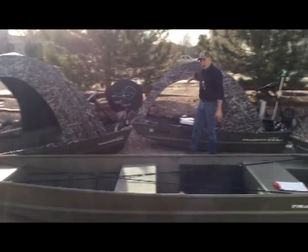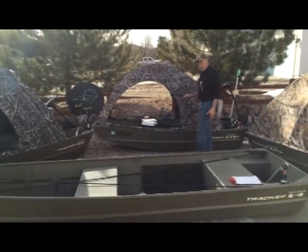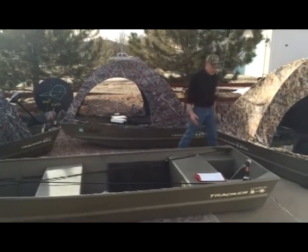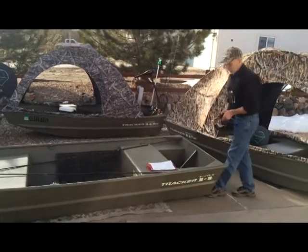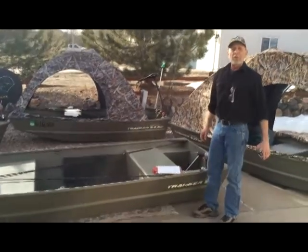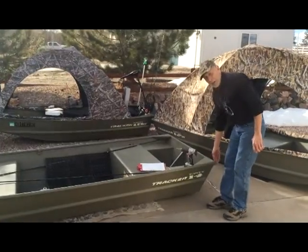Doing the Explorer model, you're going to start in the bow, and your measurements will coordinate back and give you where to start your pilot holes. In this case, we're going to be starting with our Intruder model. We're going to go ahead and pull the measurements on this here, which are going to be 19½, 43½, and 113½, starting from the aft of the boat.